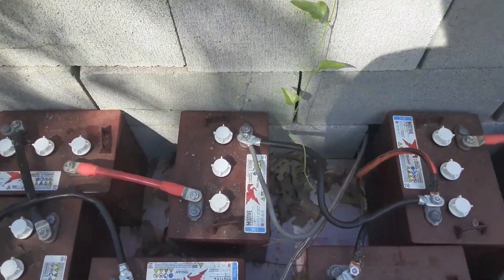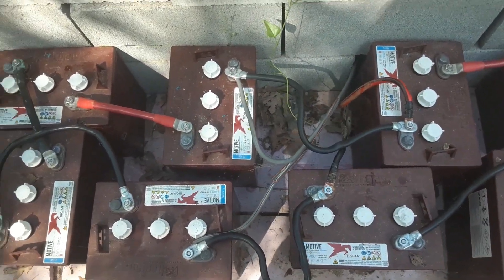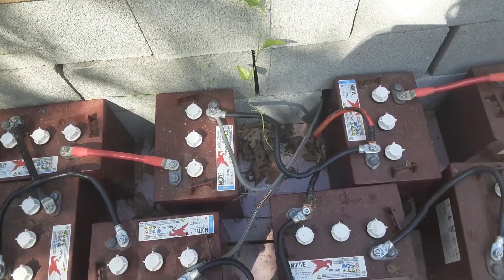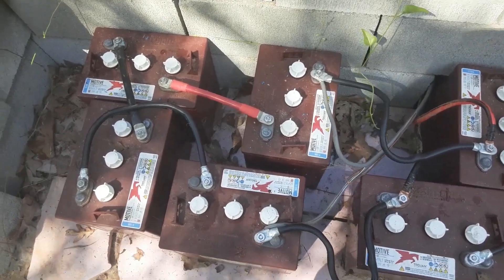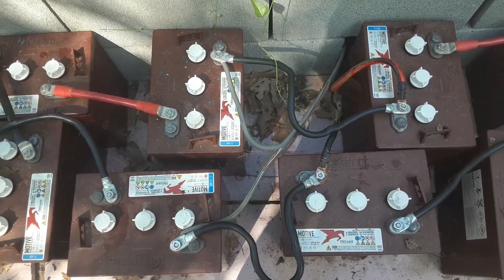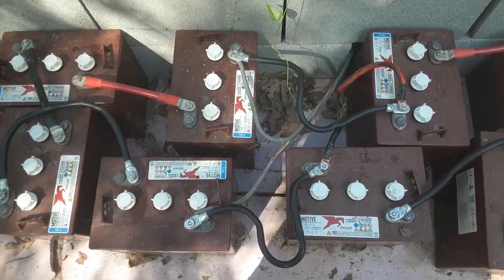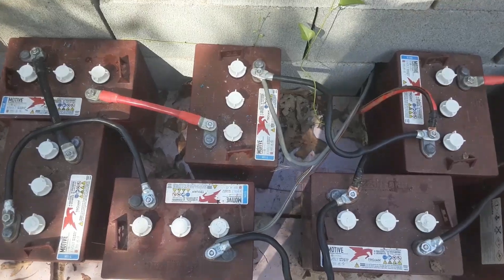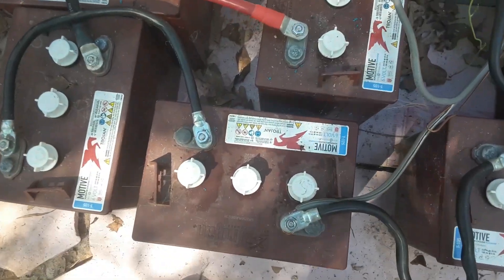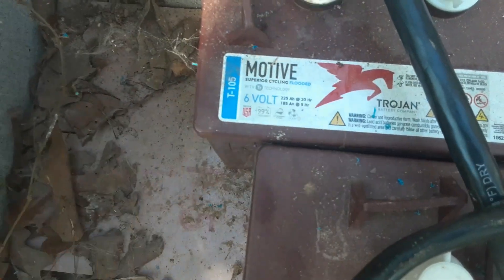Hopefully this will retain long enough for me to get it put out. Now you see this all connected here. I actually had a 24-volt system going, and I recently burnt out my inverter. So you're also going to see me reconfiguring to a 12-volt system — that's going to be the plan. I have eight batteries and these are actually 6-volt batteries.